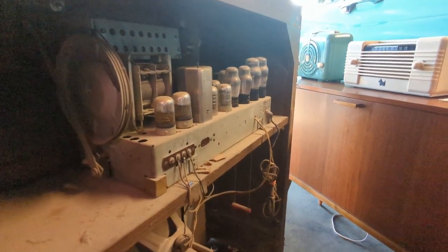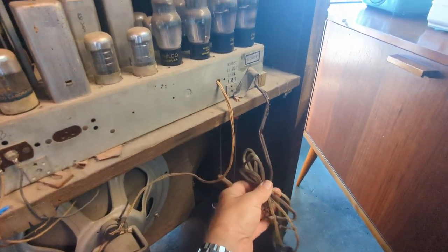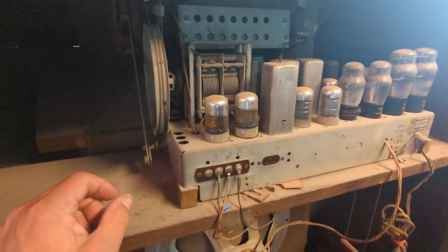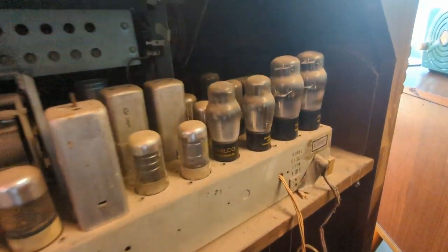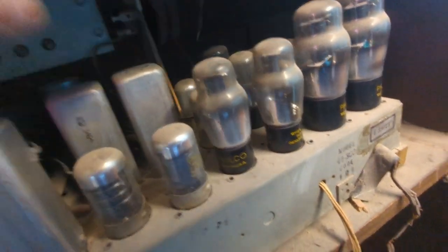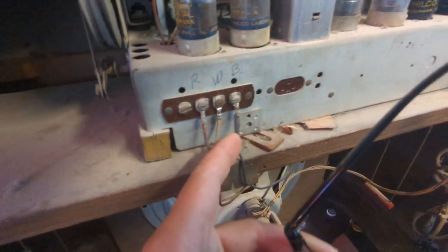So that's exactly what we're going to do — a total overhaul. She said it worked about 20 years ago and then she stopped using it because the cord started not looking good, and I'm probably not going to try to plug it in. These can be a big pain because they tend to have awful pre-war rubber-coated wiring that shatters if you look at it, and Philco seemed to be one of those companies that insisted on over-engineering things. Let me take my glasses off and look — is that cloth-coated wire? Yes, being a 1940 set, maybe it doesn't have as much of that god-awful wiring. That's all cloth. That's good. Maybe there's hope.